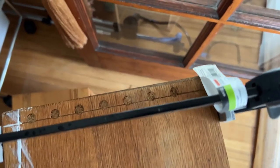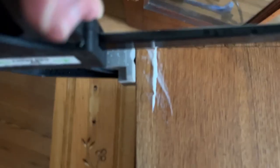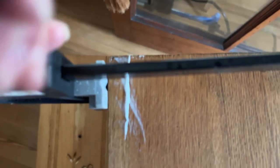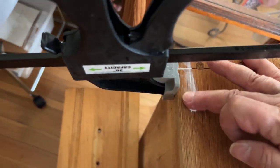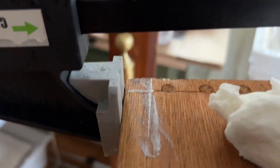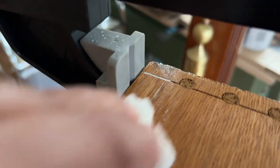Shellac serves two purposes. It prevents bleed-through, and we're all familiar with this, but it also seals in the original finish as well. It seals off the wood from what you're going to do to it. If you have a tightly grained wood, such as mahogany or walnut, and some fine-grained oak, you'll seal away the surface of the wood, preserving it for your finishes such as paint.